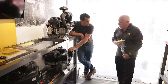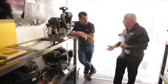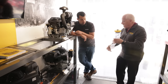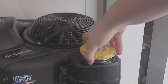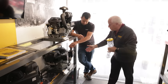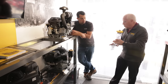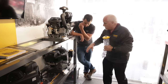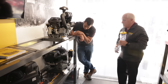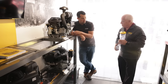Is oil guard something we've seen for a long time now? This is a smaller version of it — same general idea. It's called oil extend. It's not a unique dry sump system; it is a different sump than a normal engine just so that this unit attaches to the inside of it. But it's a simple system that includes an automotive style filter similar to what's in the regular oil guard system. Easy to change it, easy to maintain it, easy to do oil changes. The extra half a quart of oil in there, plus the same idea of taking the oil out of the engine, cooling it, and putting it back in, combined with some of the new features on the CXI engine — heavy duty cam, high inertia flywheel — makes an engine we're pushing out to be a 250 hour maintenance engine. Downtime is something that guys don't want to have but they still want their engine to perform properly. So this gives them the ability to keep guys out and make more money.